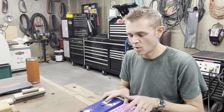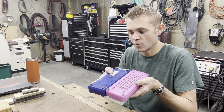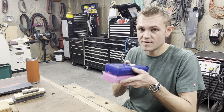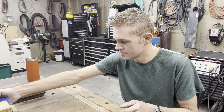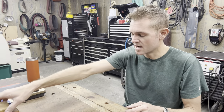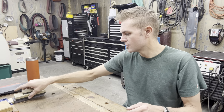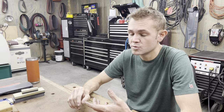So the water stones, whereas I do not use these for my personal tool honing, I do like them, and I fully admit that they make a very, very capable edge for woodworking tools. But so do oil stones, largely. Which, honestly, the Black Arkansas does yield a smoother cutting edge than the whetstones. So one could argue that maybe the whetstone cutting edge would be a little more bitey.